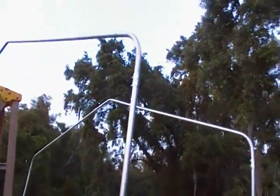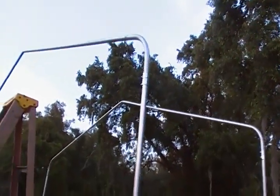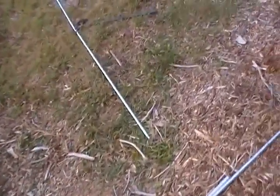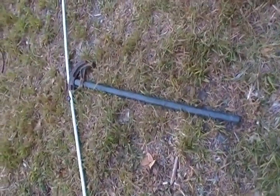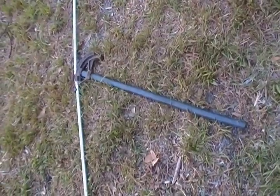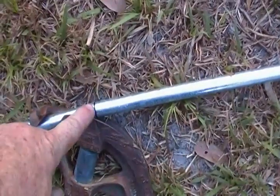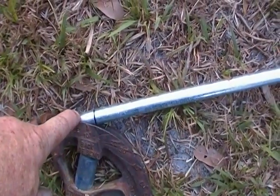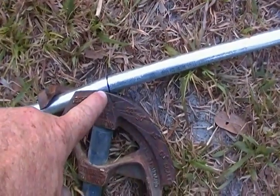I'm gonna show you how easy it is to bend these hoops. You can bend barrel hoops or bend them square — whatever you want — but this is what works for me. What you're looking at is a half-inch EMT pipe bender. These sticks are exactly 10 feet long. I've found the center — actually the center's over here — and I measured back seven-eighths of an inch. You can see that little star pointer right there.